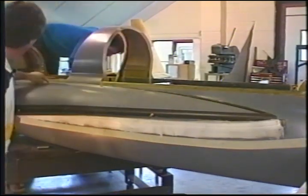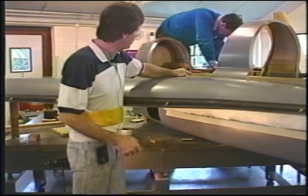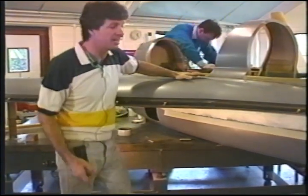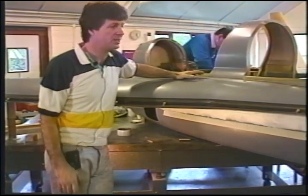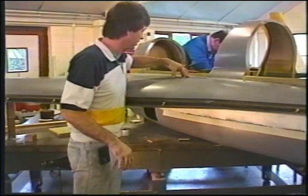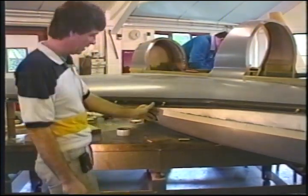And I can see right here that it pushes me up 1/8 of an inch. I reproduce these points on the other side so that when I push down I get the same results. Essentially I've preloaded the structures ever so slightly, but we've worked it out. It's about 3 pounds of force to make it go down. Everything fits together very well.